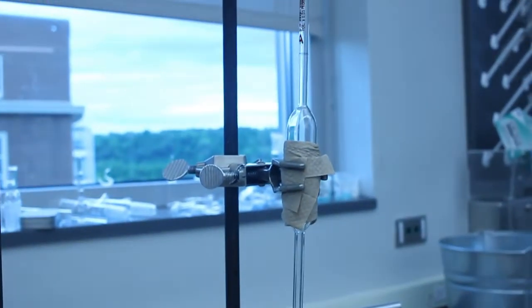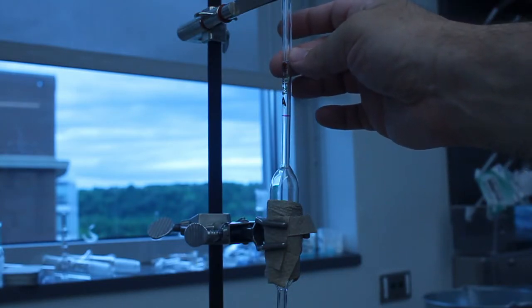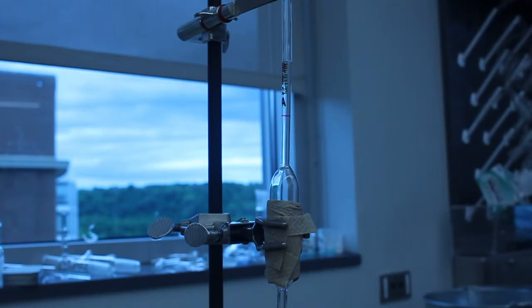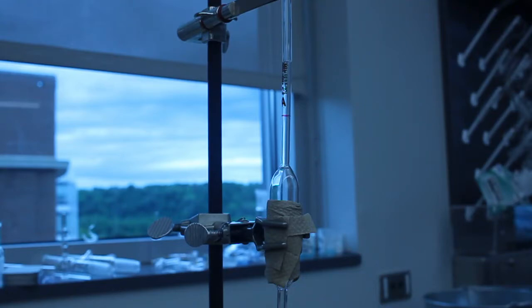So this is a case where because of what I'm fusing together, I'm going to go ahead and use my hand torch and hold the work secure. I'll be able to blow through the bottom, and hopefully that'll give me good results. And by having everything clamped up and aligned, I should be able to keep this straight throughout the entire process. Once I do have this fused properly, if I do need to make any adjustments, I can always take it out of the clamp, go to the bench burner, heat this, straighten it out, and go from there.